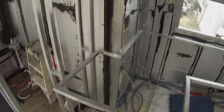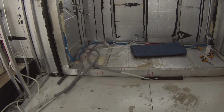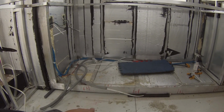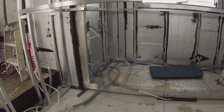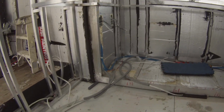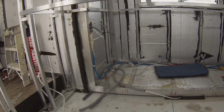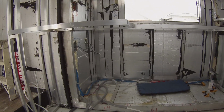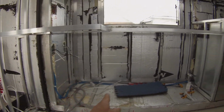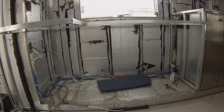Because it's going to have legs, this top piece is going to have legs that come down from here to the bottom, and the bottom rail obviously floats 4 inches off the floor, which provides my toe kick. So to keep all this in place, I'll eventually put a wheel down here, I think, to carry the weight. But to stabilize this, I'm running the cross members all the way back and tying them into the slide out. Unlikely that it will go anywhere.